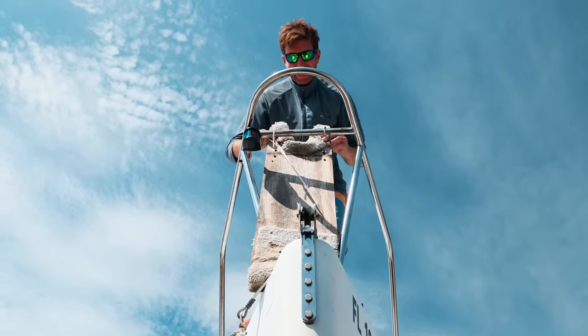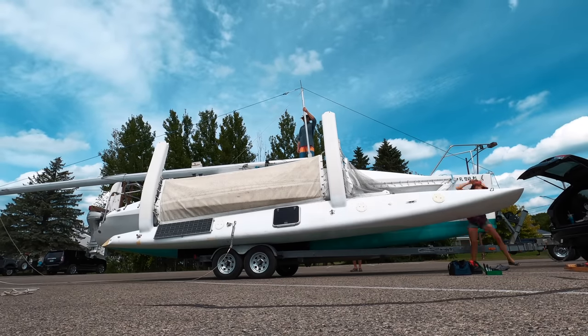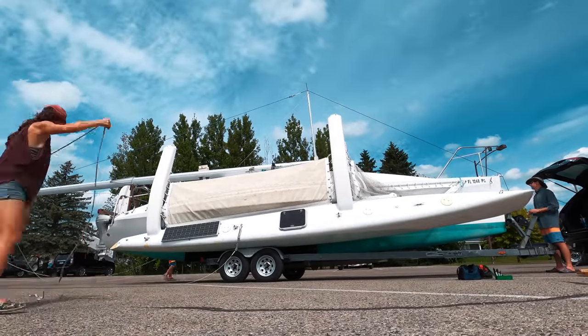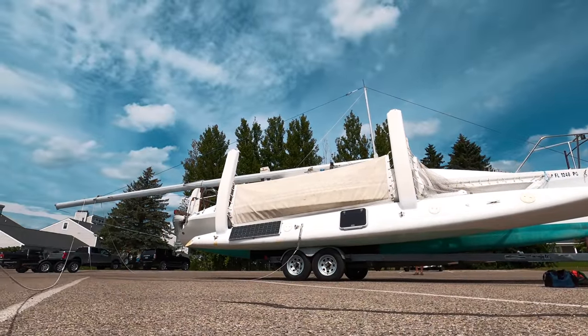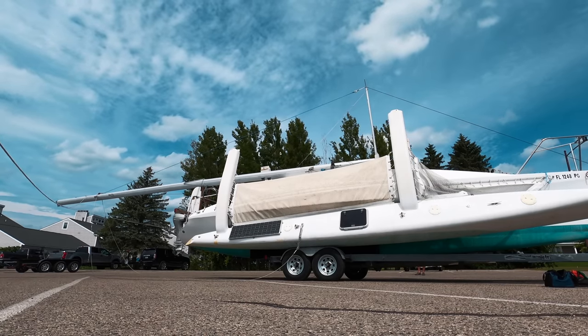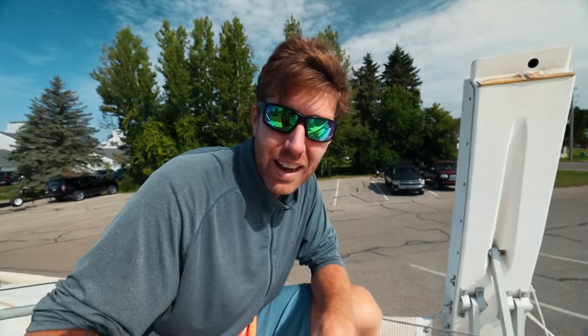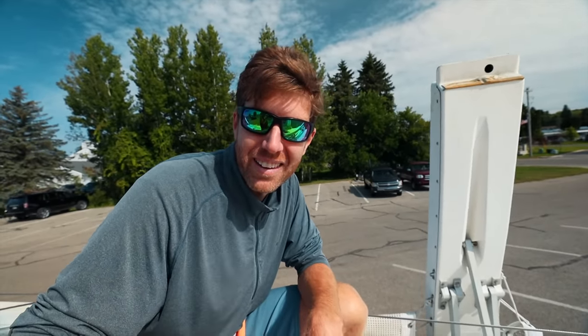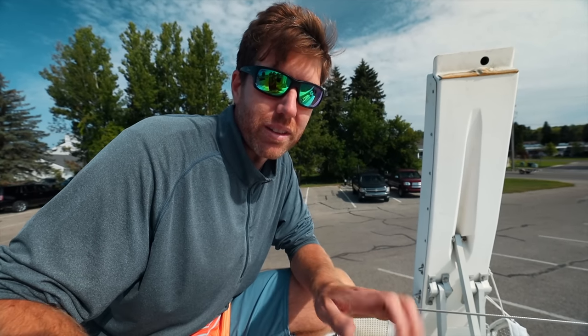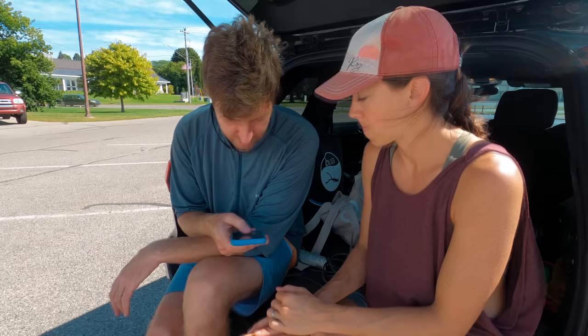Go. Good thing we're not in the water. And then you and my dad are going to control the main halyard and the screecher halyard to provide some extra support side to side to keep us vertically in line with the center of the boat. So it's gonna be a lot of yelling and shouting probably, because it's going to be a very tense moment and we're going to need to be able to react relatively quickly but smoothly. Fit the mast raising wires. And those are different lengths.